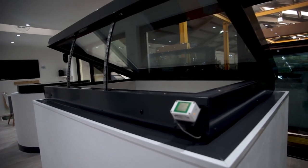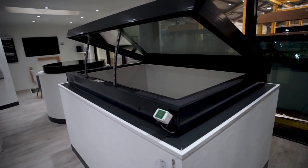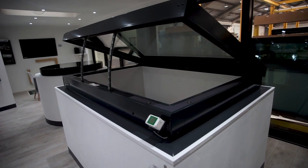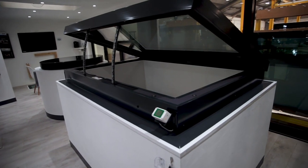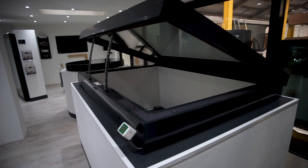The hinged opening flat roof light is designed to go onto a pre-weatherproof timber kerb, meaning that you can have your roofing membrane completed before you install the roof light. All flat roof lights also require a minimum installed angle of 5 degrees to allow water runoff. If your roof isn't already sufficiently pitched, this can be achieved by using an angled timber wedge.